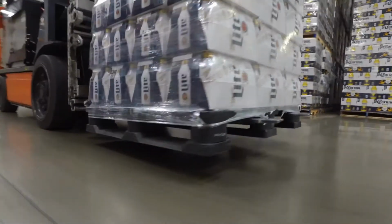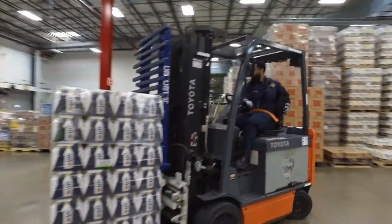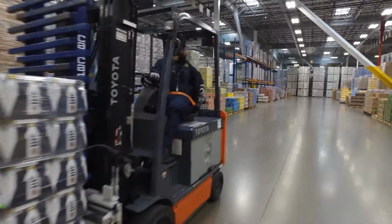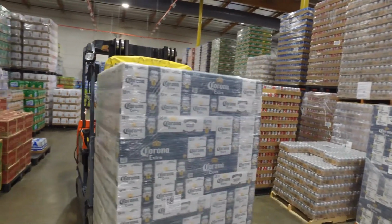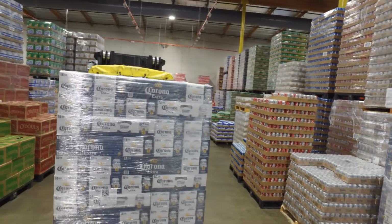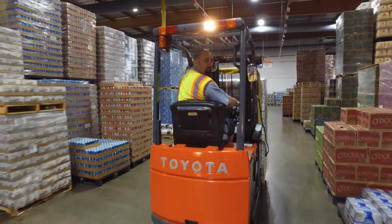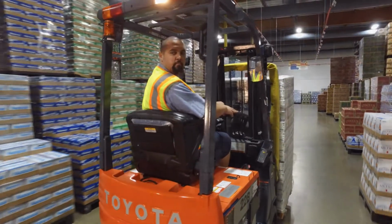Also, a forklift should not be turned while forks are elevated above 2 feet. This can move the combined center of gravity outside the stability triangle and cause a tip over. If the load being carried obstructs forward view, the driver shall be required to travel with the load trailing. Before driving in reverse, an operator must always look over both shoulders. Do not rely on mirrors.